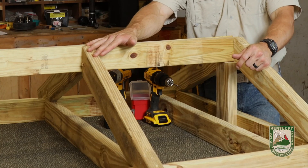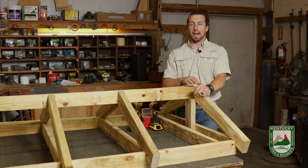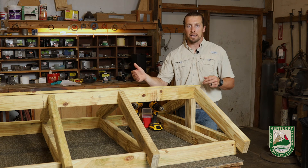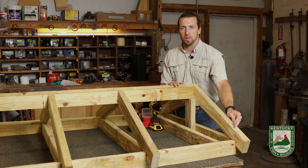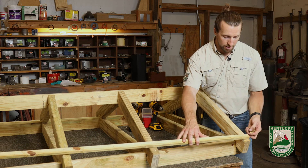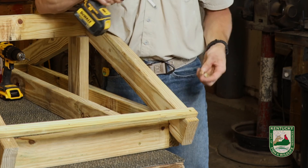I have permanently installed these rafters. The intent is to put them up after the structure is stood up and plumbed in the field, then from a ladder install these, but for the purpose of describing the next part, we'll show it. Next, you'll use these one-by-twos, cut to length – overall seven feet; rely on your drawings for that. Pre-drill them along each rafter. They're going to be installed from the nose or eave side of the roof, three high up to the top ridge. I call these mini purlins – they're meant to support the actual roof covering.